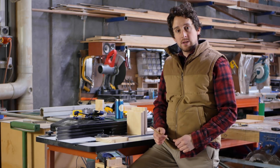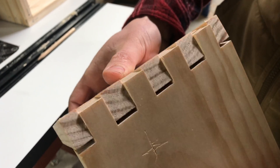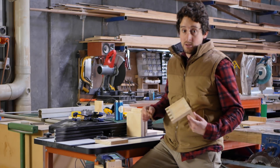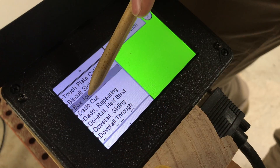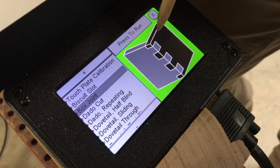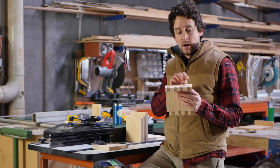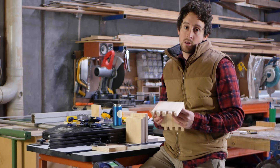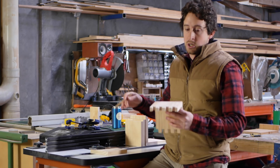I haven't had this very long. The only app I've had a real chance to mess around with is the Box Joint, which it does very neatly, but I'll quickly run through that now. It has a whole bunch of applications — you just choose the one you want, go to Apps, choose Box Joint, press to run. Then you need to make sure you've input the correct dimensions of the timber you're working with, as well as the bit, which you should have already done when you calibrated the whole machine.